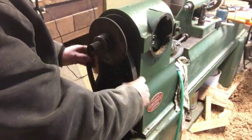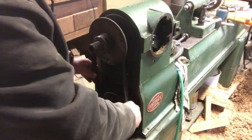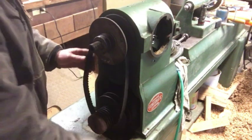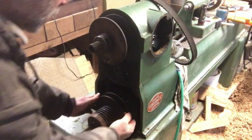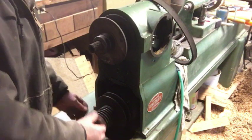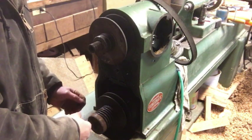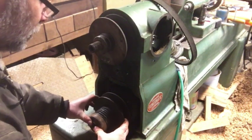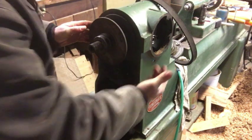The easiest way to take this off is you pull it straight back, then you pull it down from the bottom and rotate the pulley on the bottom and it comes right off. You pull this off the bottom spring portion and it comes right off. This bottom portion was pretty tight so I just took some WD-40 and lubricated it, because the old lubricant was starting to stick so it didn't want to flex in and out — that's very important that it moves back and forth freely.